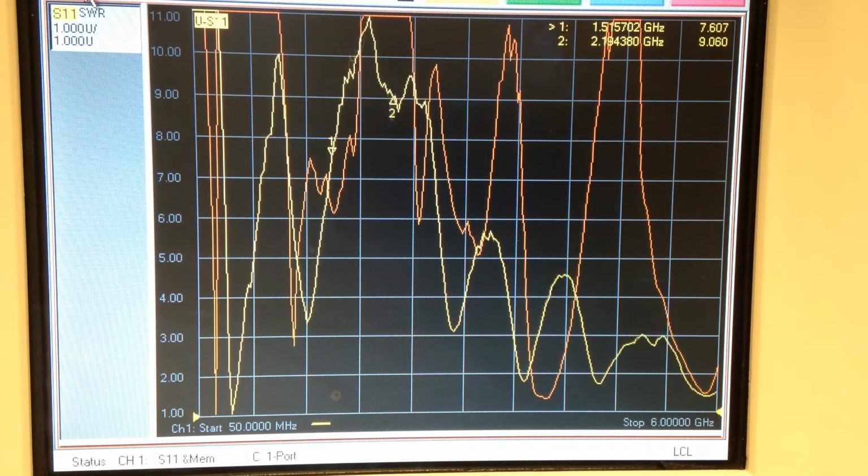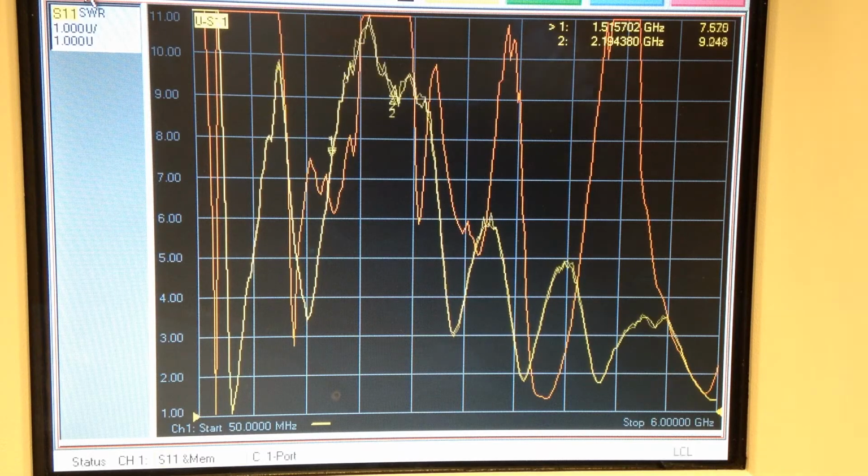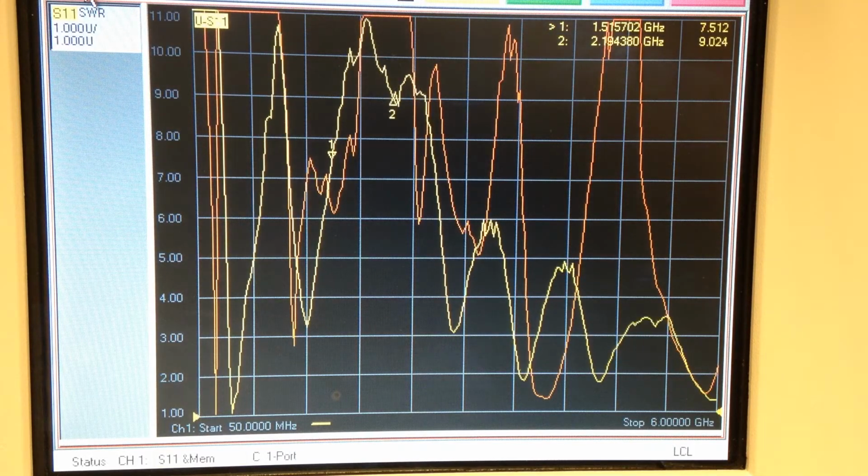With a B200, having a high power amp in there, the VSWR probably isn't going to be an issue on transmit. It's going to reduce your sensitivity on receive somewhat, because we still don't know what the optimum noise match for this thing is, but it should actually still work quite nicely for receive over a wide bandwidth.